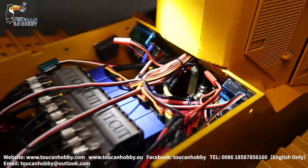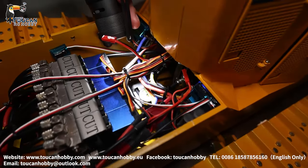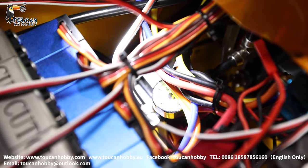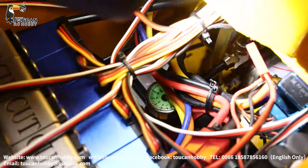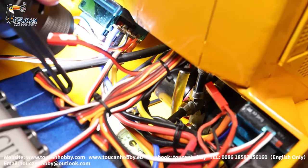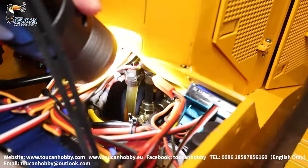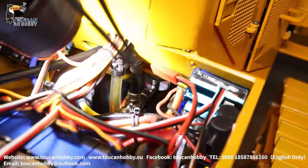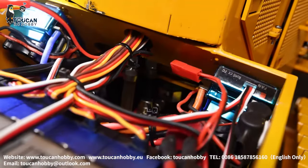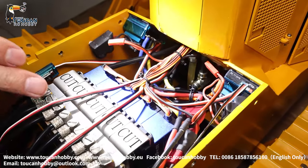Let's start the pump to see. Mix control starts the pump. The first pump — see, around 5 MPa. If we run them together, that second pump will start directly too. If you look carefully, that pressure gauge also reads around 5 MPa. Both pumps running at the same time at 5 MPa, supplying enough oil to the valve block.